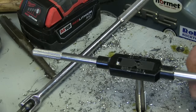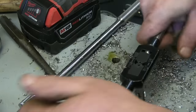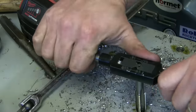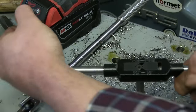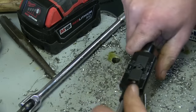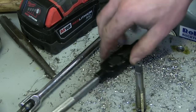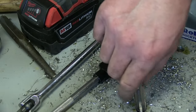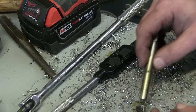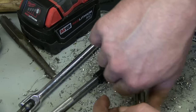This always gets me — it's a left-hand thread in here. So you try and tighten it up and it loosens off on you. A big loud snap was a tooth breaking, and the next thing after the tooth breaking is the tap breaking. False alarm. Better safe than standing here for four hours cussing and sweating trying to get a broken tap out.